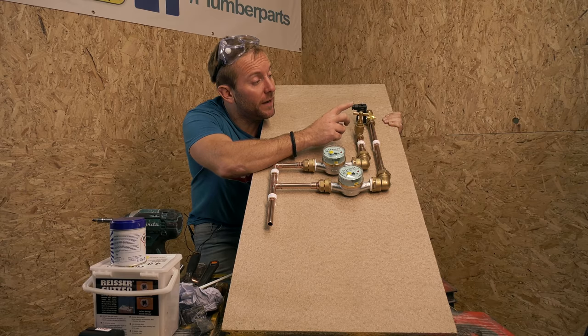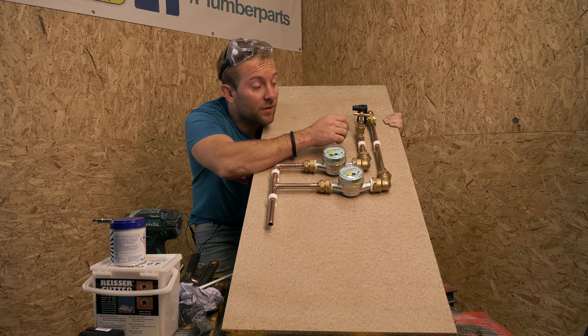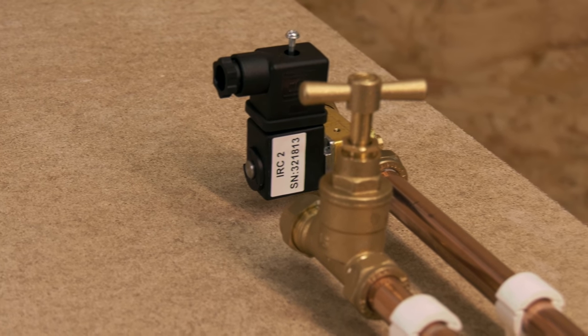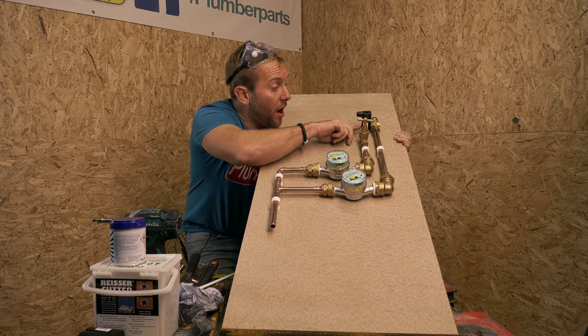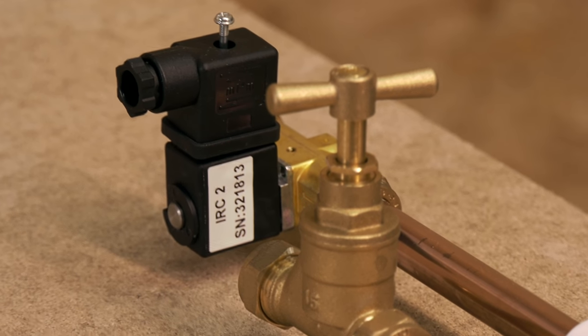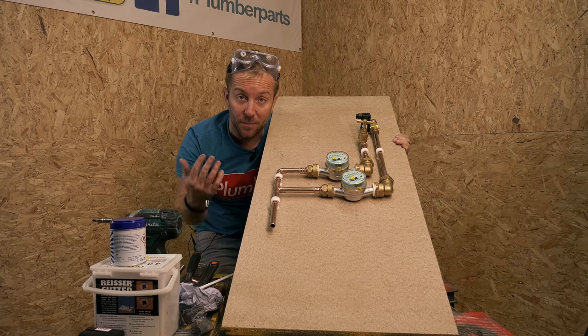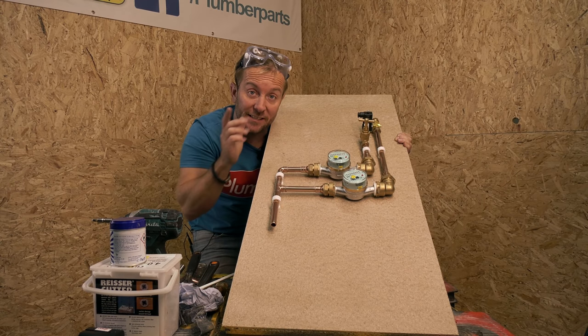And that's where you sort of leave that valve just open a little bit so water can trickle through, slowly fill the cistern up, and then every so often, according to the siphon unit, do a flush. Then we've got our Cistermiser IRC on here that we're gonna use to control our other urinal. And then, with any luck, after I've been running my studio as a pub for a night, we're going to be able to read these and see the difference.